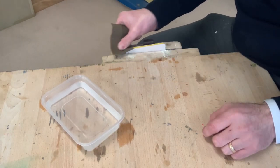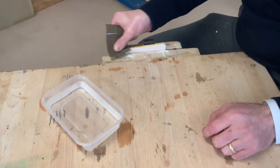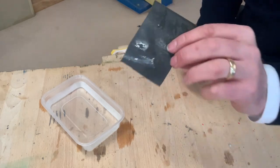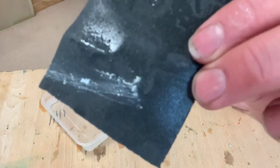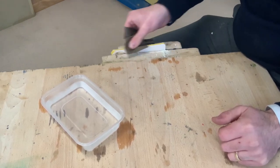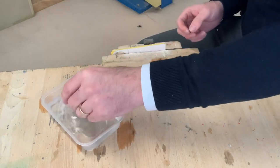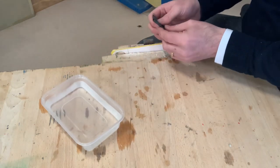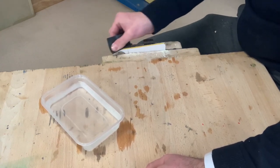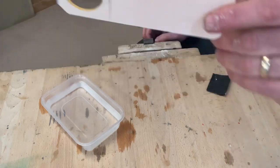If you've successfully got rid of those saw marks, you're gonna have a very nice finish on the edge of your acrylic after this process. Because all you're doing at the moment is removing a fine layer of acrylic to remove those scratches. So you can see the acrylic is sticking to the wet and dry paper at the moment. So finishing is very important because it's gonna add aesthetics and appeal to your project, okay? All right, it's gonna give it that wow factor. So after all that hard work that you've gone through, the marking out, the cutting, the shaping, it's always beneficial to spend some time on the finishing process, so that you've got rid of those fine scratches. Okay, you can move on to the next slide.